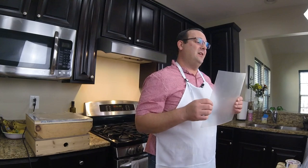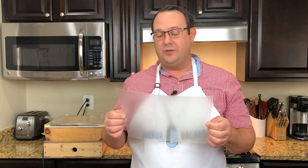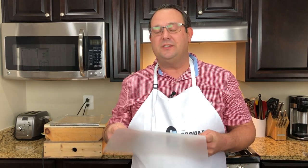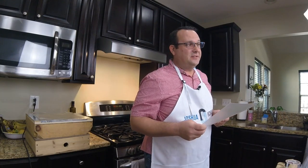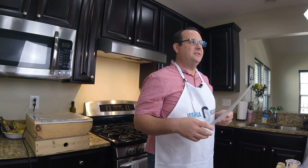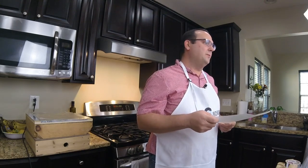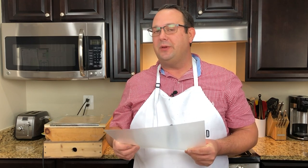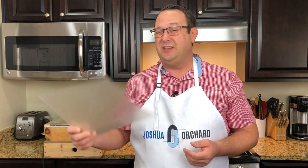The first material we're going to need is the plastic itself. This is a pre-cut plastic — 14 by 14 inches that I had purchased years ago. Unfortunately, this supplier has vanished, left this world peacefully, I hope. But this is 0.020 inch thick plastic. This is PETG — the same type of plastic used in soda bottles. Now you can get large pieces of this from various manufacturers, but generally it's the thickness that you want. I don't recommend going thinner because as the plastic forms over your part, it's going to stretch and make the plastic even thinner, making it subsequently weaker. Maybe go to 0.030 or 0.040, but it's going to take more heat and be a little bit more difficult to form. In my experience, 0.020 really is the way to go.